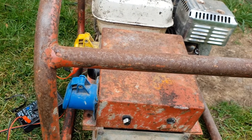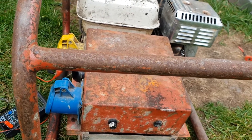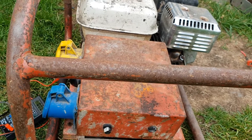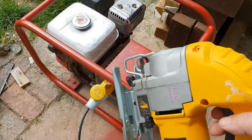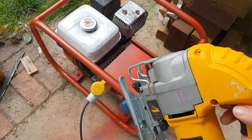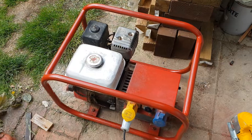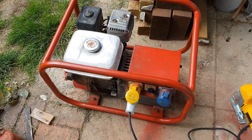This is very common with these generators — anything that's been left for a while with a dead generator output, you see them for sale all the time. Good chance it's just a capacitor. Whip it out, swap it over — don't touch the ends because it could still be live. An easy fix really. Lick of paint, good job.